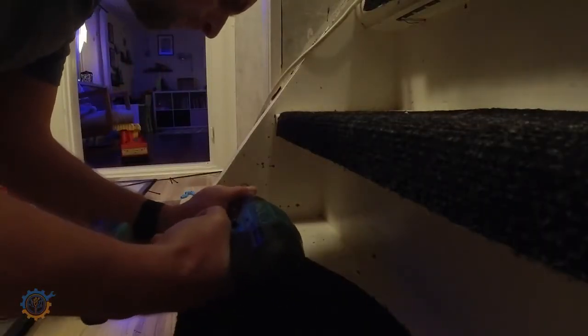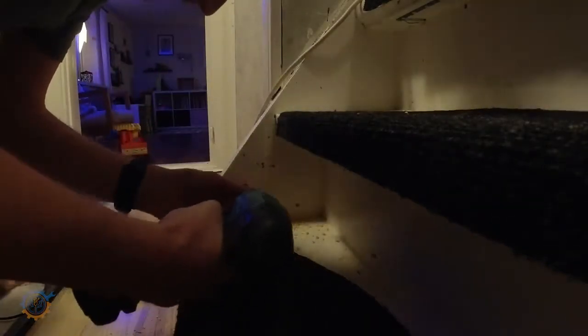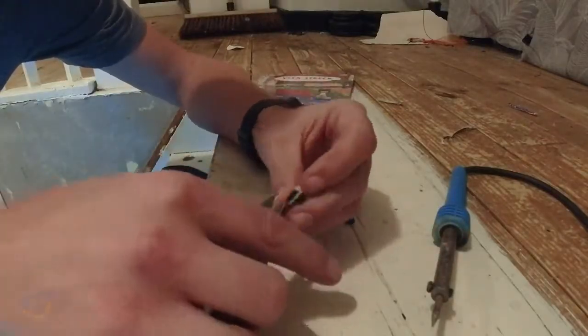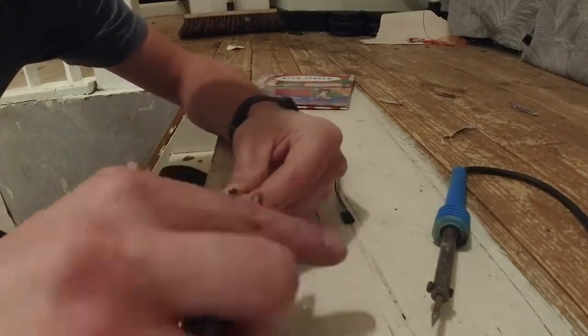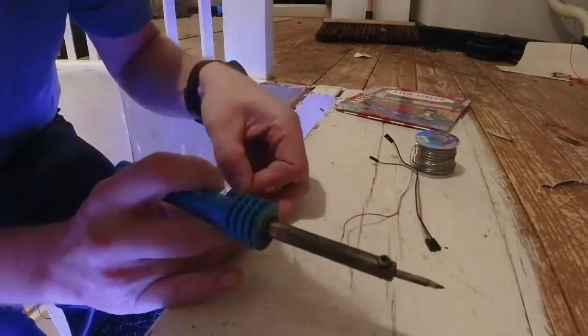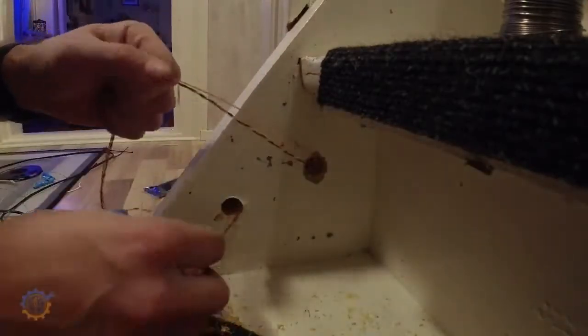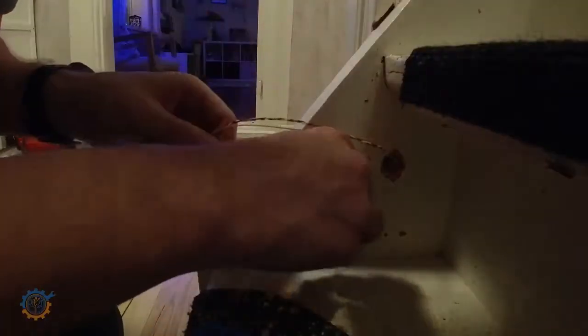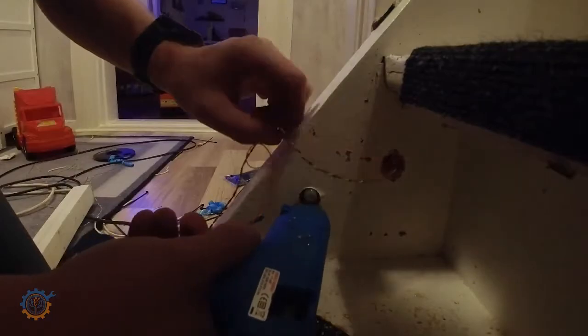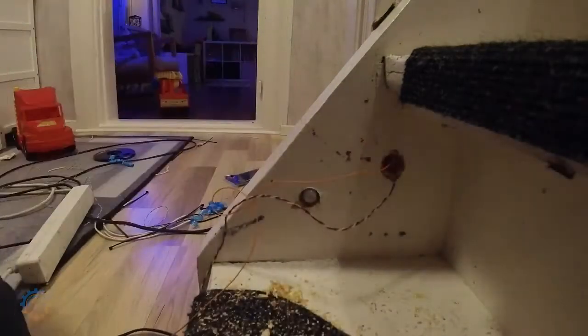It's now time to add one of the PIR sensors. This is the bottom sensor, so I'm drilling a hole into the side where it will be mounted — this side of the stairs will be recovered and repainted later on. I'm preparing the PIR sensor itself for soldering and adding the wires to it. The PIR sensor is very small and you cannot set any variables on it, but it's perfect for the stairs since I have the logic in the ESP8266. The sensor will be added with some hot glue inside, and there will be a 3D-printed part on the outside.